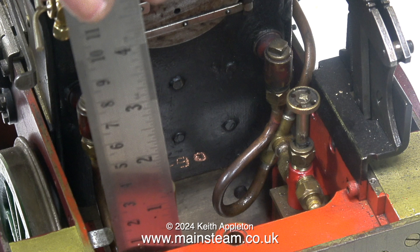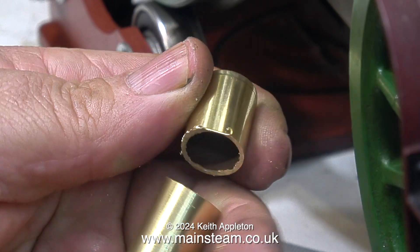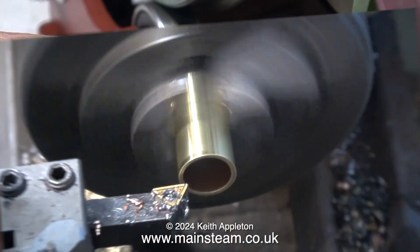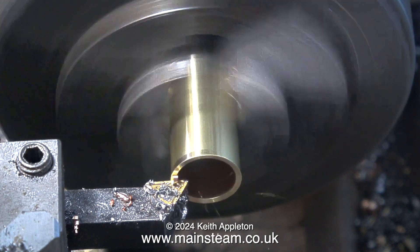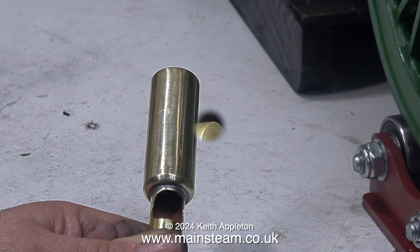This is an extract from earlier in the series. I cut off the end of the whistle using my bandsaw, then machined it in the lathe, then made a special adapter fitting to go into the end of the original whistle to allow me to fit a larger diameter tube on the end.